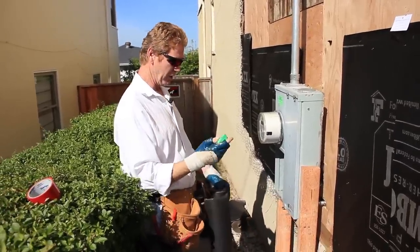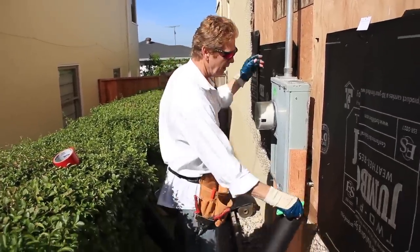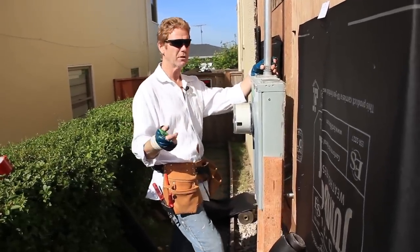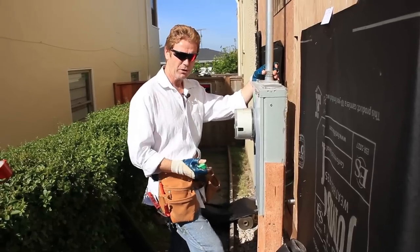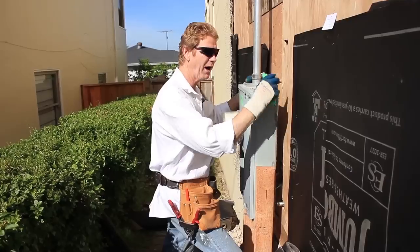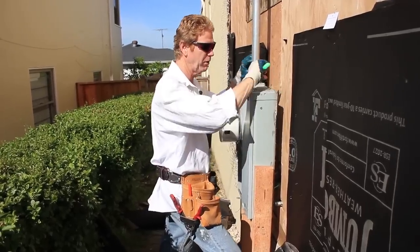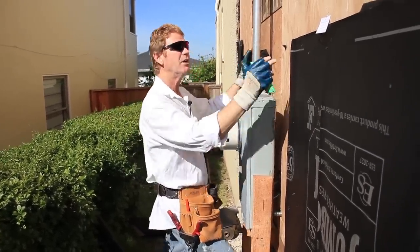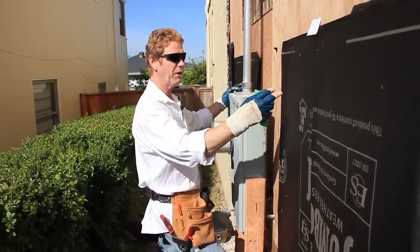What we're going to do here is — and I get this year after year, folks call me all the time and say, Kirk, can I coordinate it with you and the electrician? The city wants to see paper behind this box here, guys. You can't go flush and put a little ring around here — I've seen that 20 times. You can't do it. So what we're going to do is slide some paper under here.